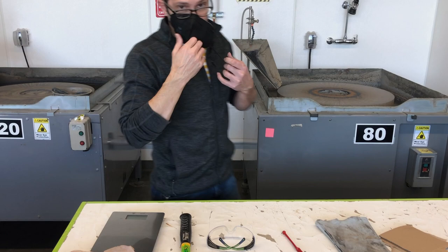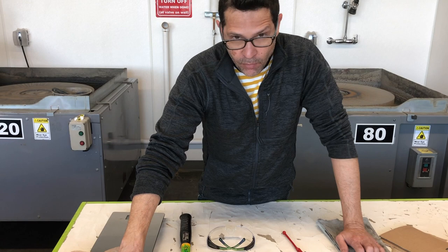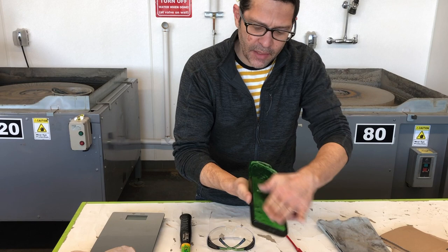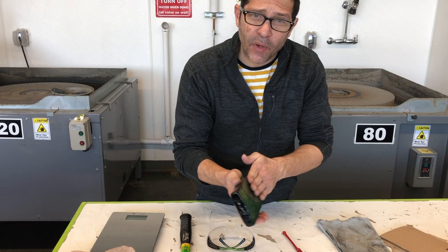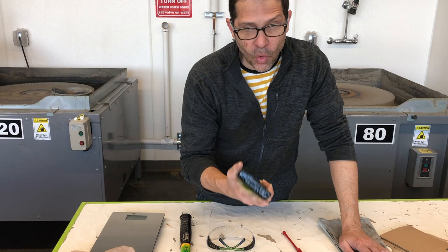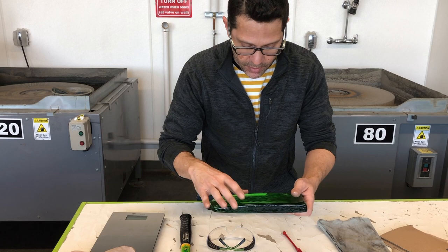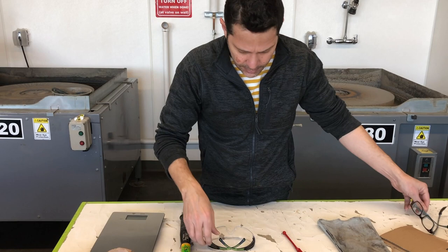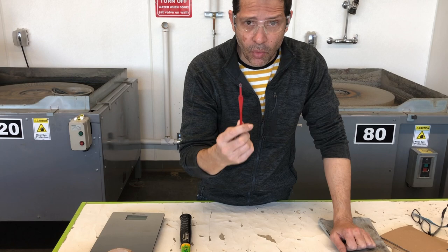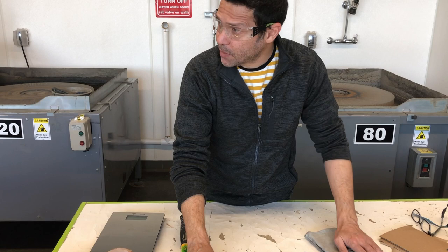Let's talk about preparing your glass if you're using billets. This is called a billet, or a blank, or a doll depending on where you get them. We make our own but also buy from Reichenbach, Bullseye, and others — a lot of places make them in rectangles which you can score and break. To do that you need safety glasses, a glass cutter, a robust leather glove, a hammer, a piece of cardboard to protect the billet, and a scale to weigh what you end up with.